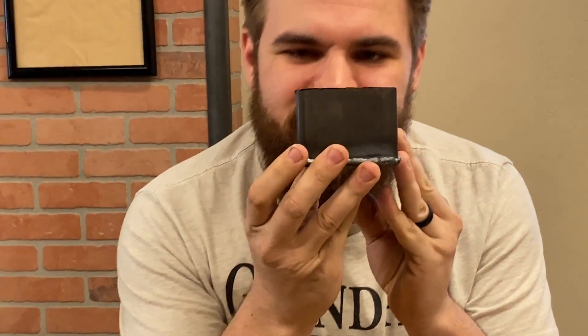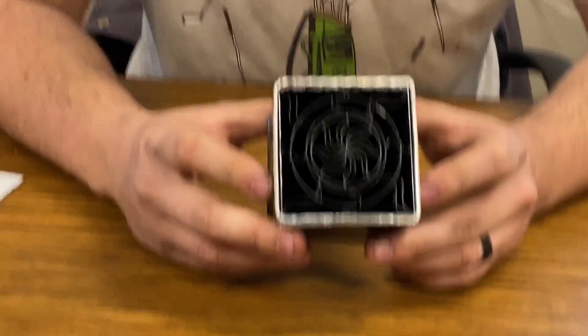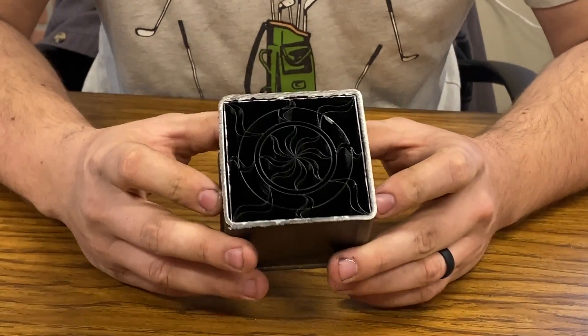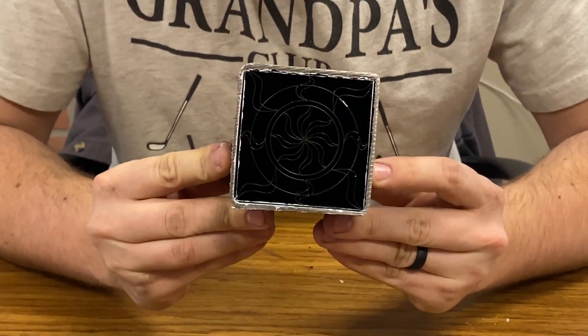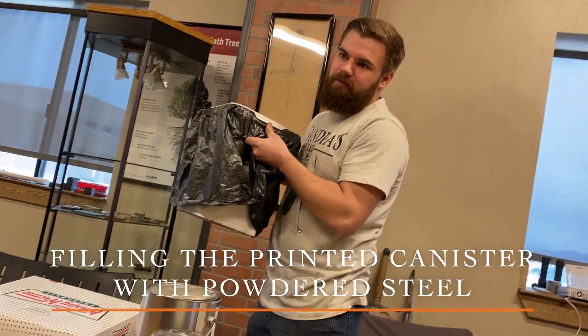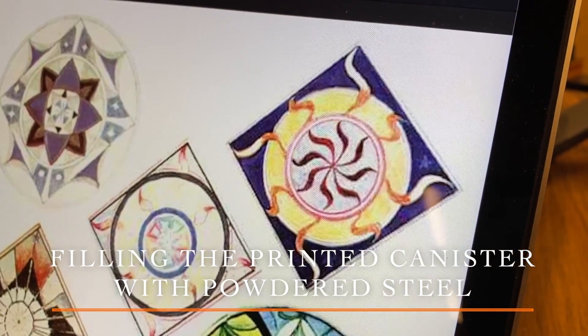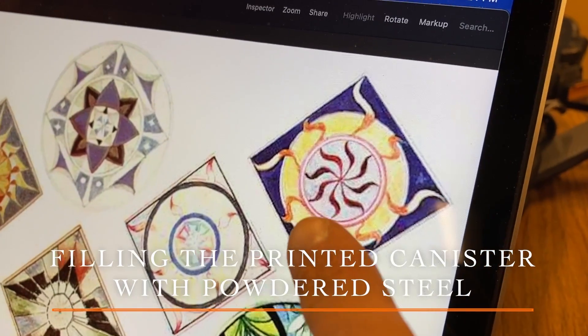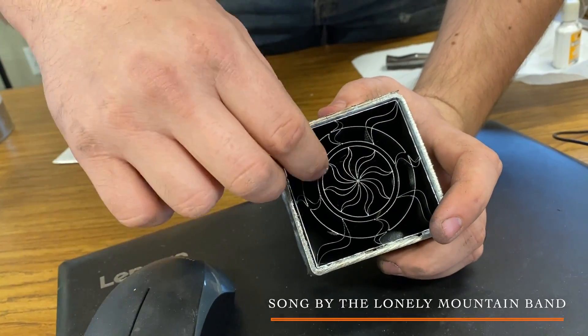Just like that — nice and flush. It's a little lower than the top of the can, but that's probably ideal, actually. You probably want it lower because with that first initial squish, we don't want it to break the PLA. So the 3D print serves as walls of the design that delineate between different types of powdered steel, which result in different contrasting colors and textures in the finished solid mosaic billet, if successfully forged. But a lot has to go right for that to work.